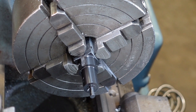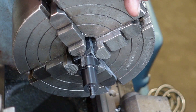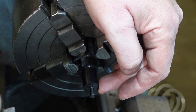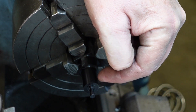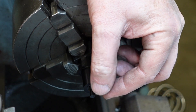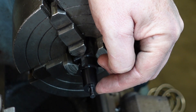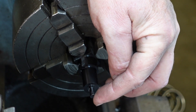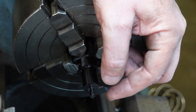A couple more things about plastic: thermoplastics tend to be very static, so you'll get lots of little bits hanging onto the work, which can get in the way and obscure what the tool is doing. Also, I need to put a 19mm long, 4mm diameter section on here — easy for injection molding, but a little more difficult for machining. There's a rule of thumb that your stick-out should be a maximum of three times your diameter, so I've gone back to about 12mm, stepping from diameter 5 down to diameter 4, and I'll shape the bullet-head tip and take back another 7-8mm to achieve the required stick-out.